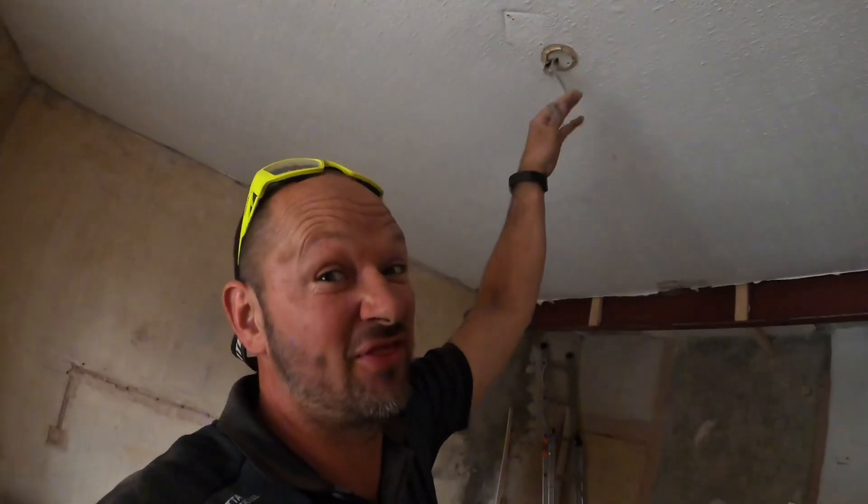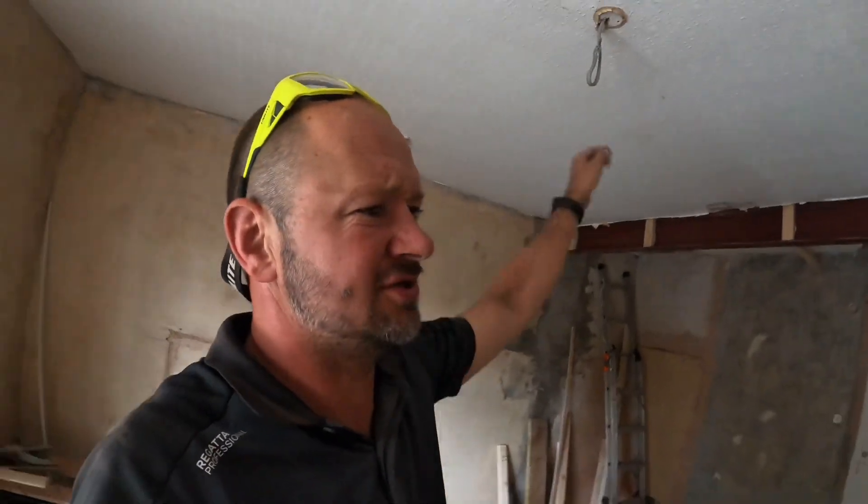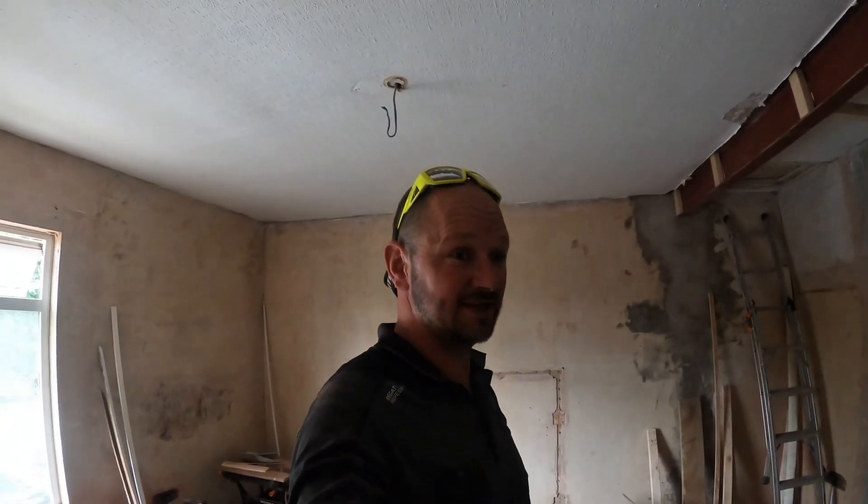So I'm just going to pull them through, and that is first fix done for these sockets for now. We've got them all under here and that's just going to be a draw wire — that's still one of the three-core cables. I'm using that as a draw wire because I couldn't be bothered running around in the loft. I've got the light switch in there, the 25mm box in case there's a dimmer going in, and straight up for your live and neutral. So stay tuned — more likely you'll see the second fix next. Thanks for watching, and if you've got any tips, let me know. I'm always open to tips — I think I know everything until someone tells me a better way, so tell me a better way.